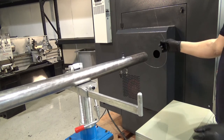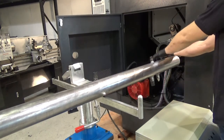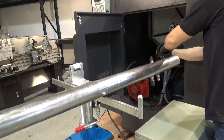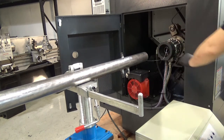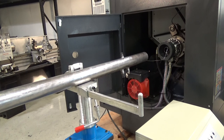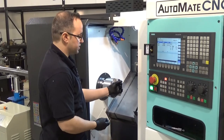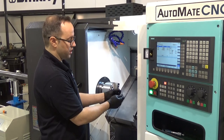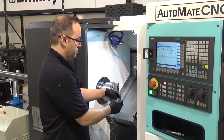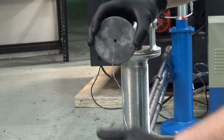It helps a little bit if you open the access door — it just gives yourself a little more light and a little more space. We're going to do the exact same thing and thread it through here. Now that we've pulled the safety wire, or guide wire, through, we're going to attach the lighter gauge vinyl string, and this will be what we actually align the two bores with. Now we're just reversing the process and we're going to pull the guide wire back away from the machine and pull the alignment wire through.